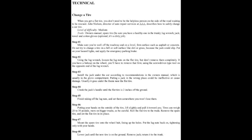Step number 5, on a single handle faucet, you'll now see a metal ring. Tighten it with needle nose pliers. If you're lucky, this will fix the leak. If not, forge on. But because single handle faucets vary by brand, your best bet is to follow specific instructions that come with the replacement parts.